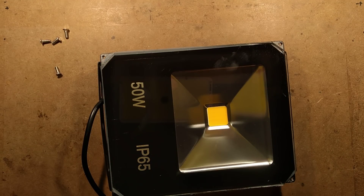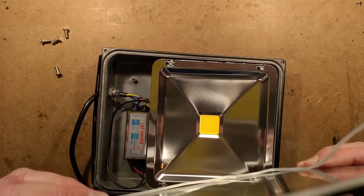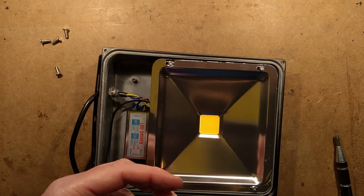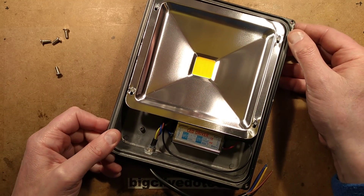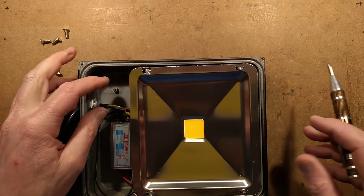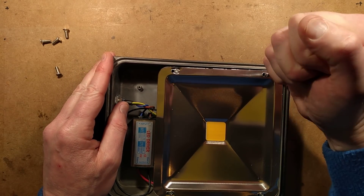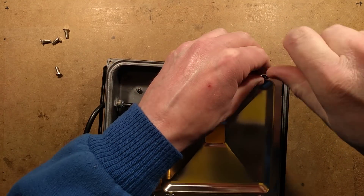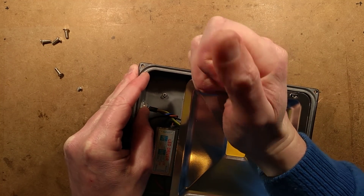The reveal is about to happen — what's going to be inside? Is it going to be one of the big chips? Here's the glass with the seal, and a little bit of foil over the back to make the numbers look metallic. I'll put the glass down where I can't drop it. There's a driver. So what sort of LEDs are in here, and where's the earth? I've just spotted the earth. I think the earth test would not have passed a bond quality test — the earth wire is not attached, it's just dangling against the case, as is often the case with these.